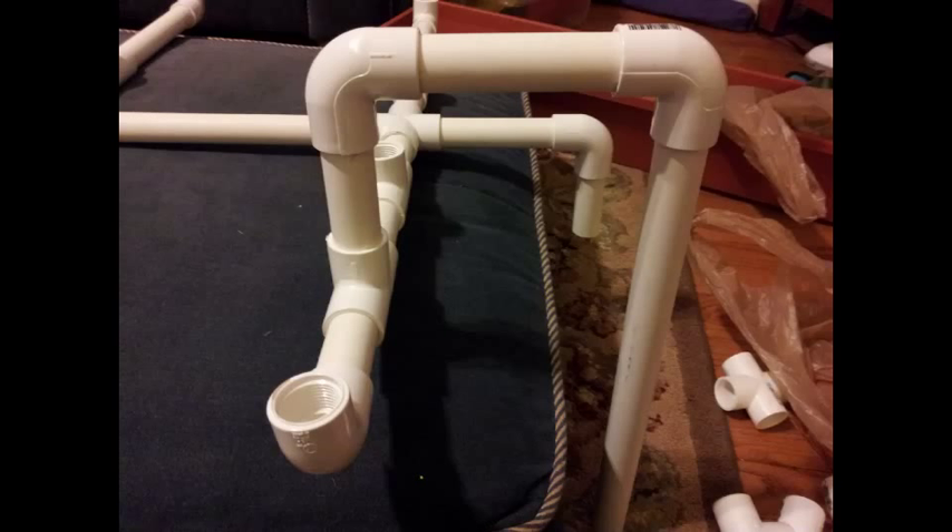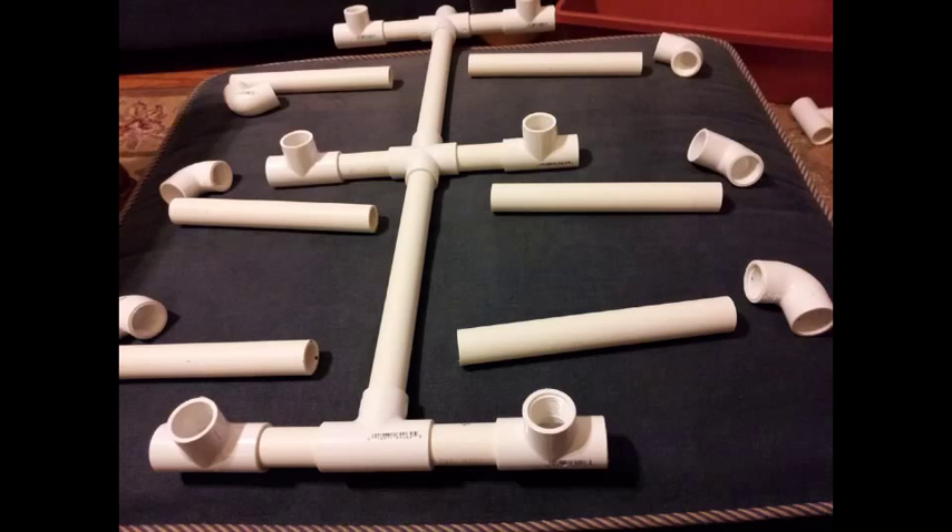It's okay to set the overflow together up to the point where it goes into the bucket, but you'll want to cut the last little bit of pipe to fit. The overflow and the inlet water pipe both have to be cut to fit at the time you're setting up, and depending on where you're setting it, it'll be a different height. I have the measurements from my website. I cut the center pipes at 12 inches apiece; the pipes coming off the center are 3 inches apiece. That way when glued into place, I'll have 6 to 7 inches between planters. The end pipes are between 5.5 and 6 inches, giving me 6 to 7 inches of growing space for every planter.